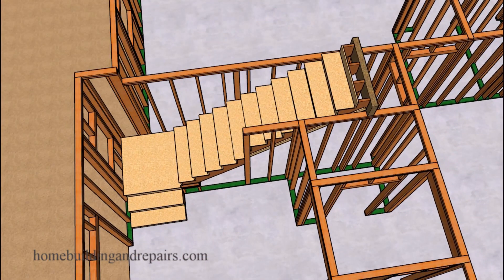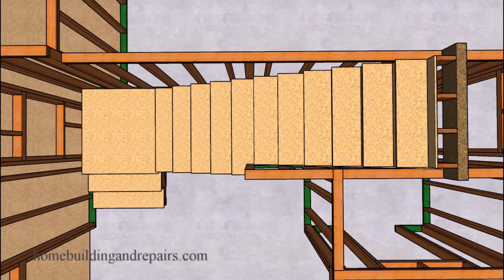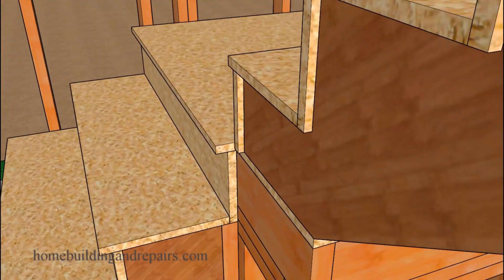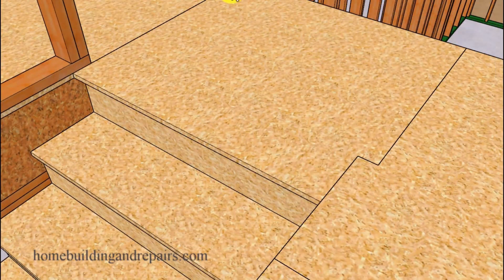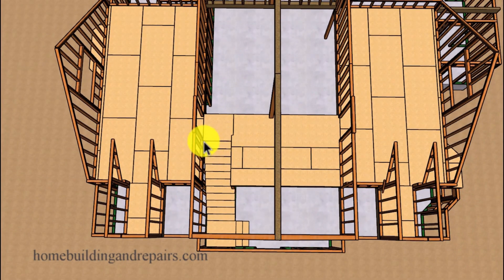So let's take a look at what the stairway should look like. You might be working on a project that has a set of plans, and the plans usually show the upper floor line and the location of the stair steps. However, most stair builders, including myself, rarely build them to those exact specifications. A good example of that would be the front step right here does not line up with the edge of the stairs, however this side here will line up. We'll take a look at the head out and the floor sheathing to provide you with an idea of where the last step will be located on the upper floor.